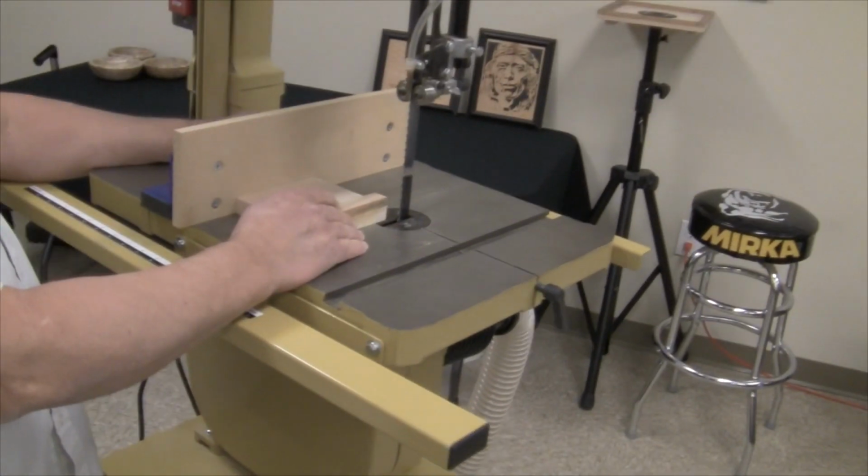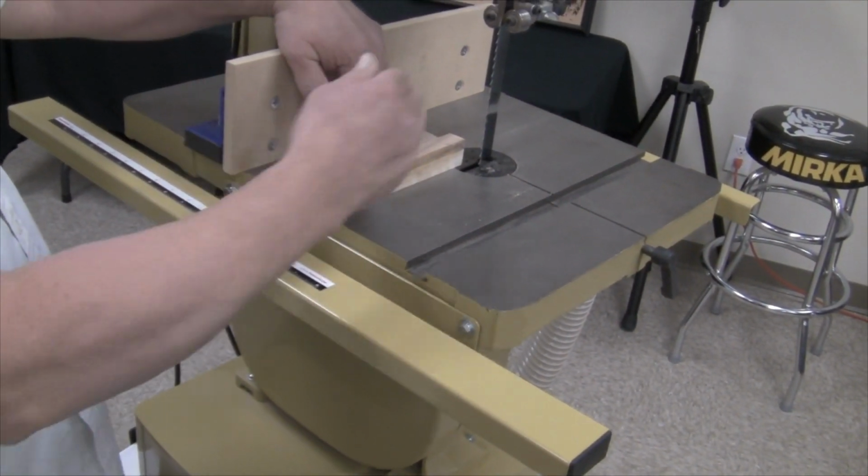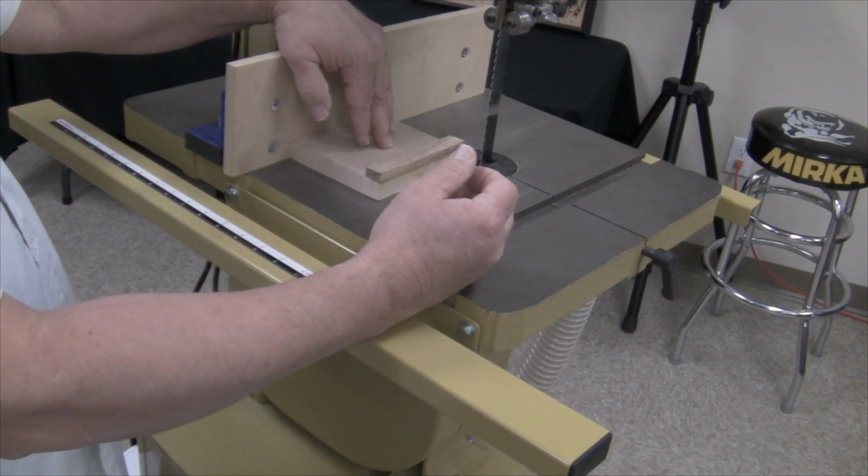Have you found that in your process of cutting, like resaw and thin stock, that your keeper part of the wood is between the fence or on the other side? I've heard some I do it on the other side. So I try to put the main part of the wood here. If I'm just taking off like a 1/8 inch or something like that, I put the main part of the wood here and push it through, and the part drops off. That's the part I want to keep. That's your keeper part. Yeah.